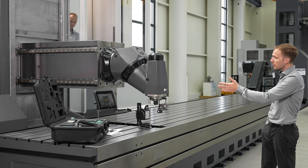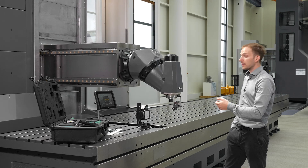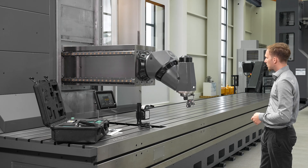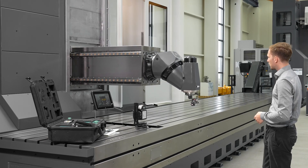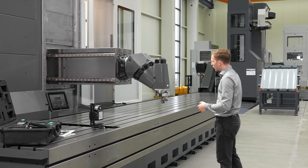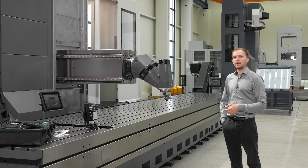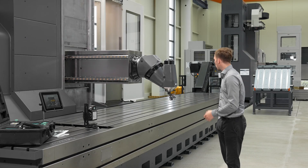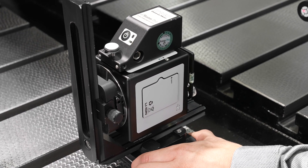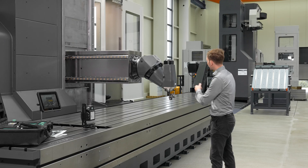Bernd, please move the X-axis a little bit so we can check if the alignment is good or if we have to align the laser. We can see that the laser beam is moving a little bit to the side, so we do a rough alignment by simply moving the laser itself. I go to the laser and realign it so that the beam is in the middle of the center cap.